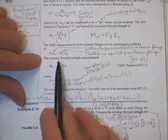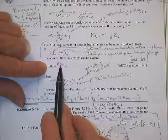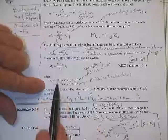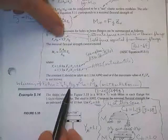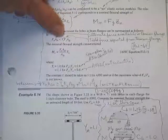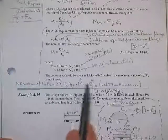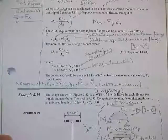So basically he summarizes it as follows: does your ultimate force available in the tension flange under ultimate stress with area truly there come out smaller than the 1 or 1.1 factor times the yield stress times the gross flange area? If that is true, you must account for the holes. The nominal moment equals F sub U times the net flange area over the gross flange area times the elastic section modulus. If F sub U times the net flange area is greater than or equal to that threshold, you get the full plastic moment and do not have to account for the holes. We're talking nominal moments, just like the specs do.